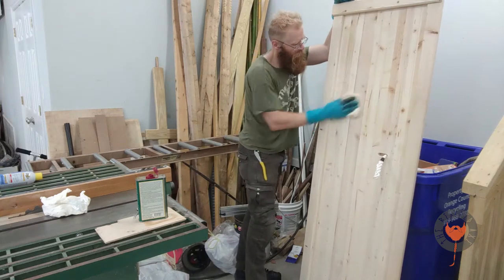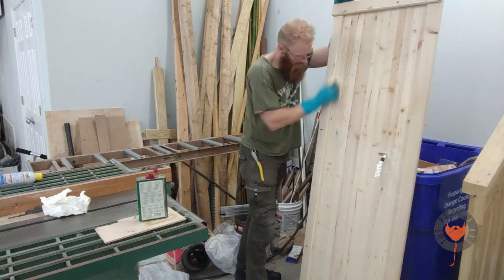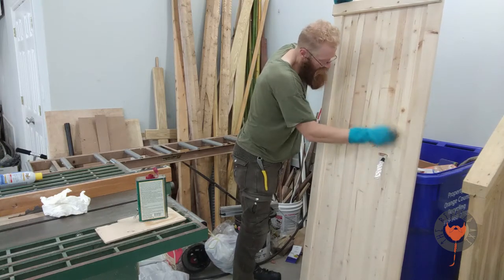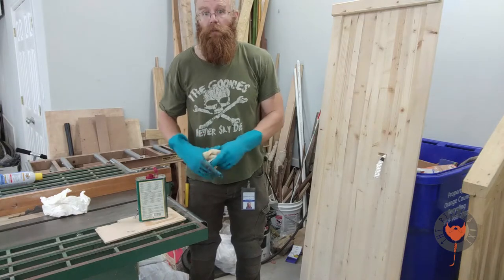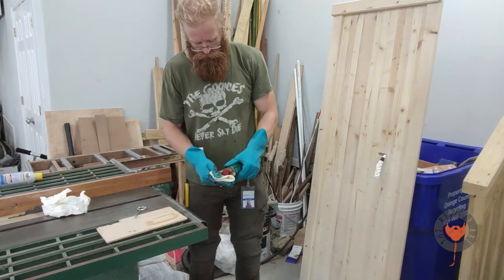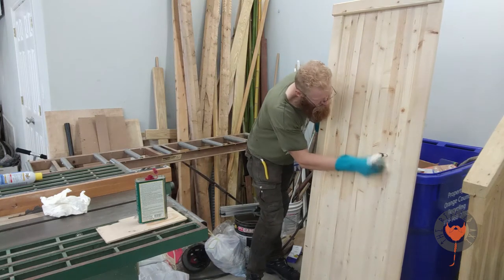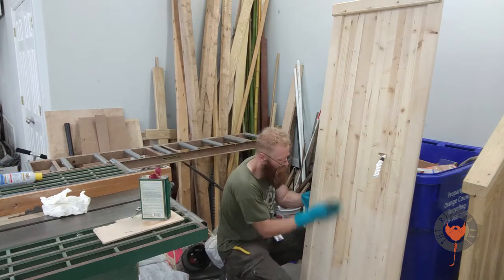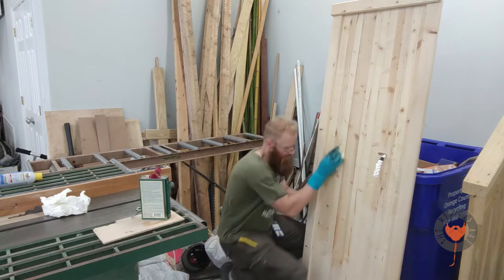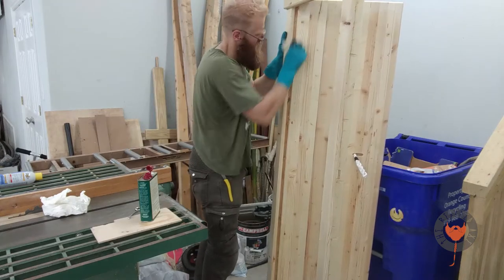Now I'm applying the tung oil and I'm rubbing it into the wood. It's going to take two or three coats at least, and you're going to have to constantly go back and re-wet your rag — you've got to use a rag. A brush or roller just isn't going to do it. You don't want to go on too thick. Thick coatings won't dry nearly as fast, or at all. I've had some coatings that just remain sticky forever. Past projects I'd have to strip that old sealant off and sand it off — hours and hours of work to remove it. So nice thin coats with a rag.